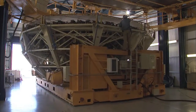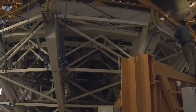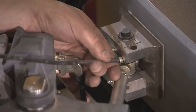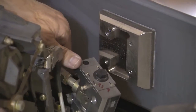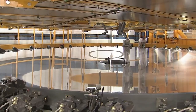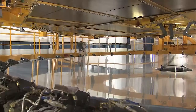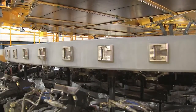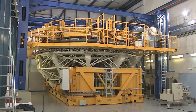The first task at the mirror maintenance building is to remove the mirror from the carriage and its cell. The carriage is positioned under a custom-made handling tool. Brackets connect the mirror and the cell, and engineers have to release each one manually. This may sound like a routine job, but with the sensitive mirror surface only centimeters away, it requires the team's undivided attention. Forgetting to take off even one bracket could damage the mirror severely during the lifting operation. The team is only ready to lift the mirror off its cell after a triple check of every bracket. Hooks are lowered to bear against the back of the mirror and the handling tool lifts the mirror up and off the cell.